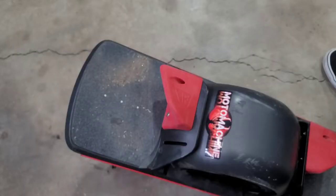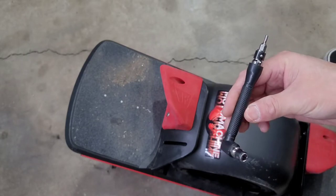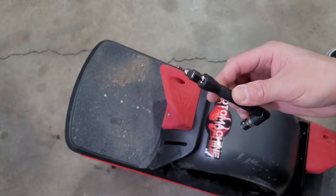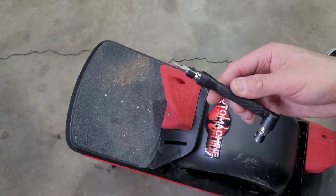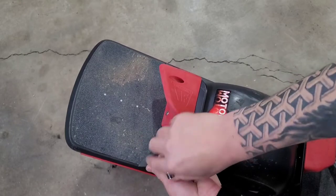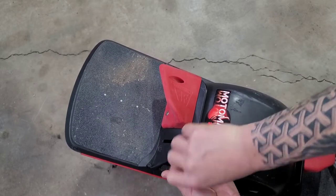To begin, we have to take off the front foot pad. Since I have Flight Fins, I have a different screw — a 2.5 millimeter hex. I'll go ahead and put a link to the toolkit in the description. It's a very handy little compact kit I use to travel with. We'll start off by taking off the Flight Fins just on the front — four screws. Loosen all four before removing.